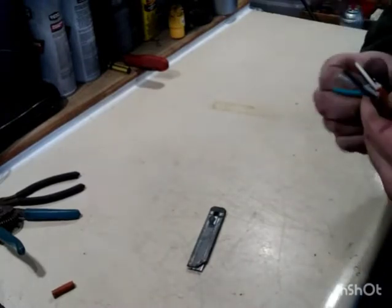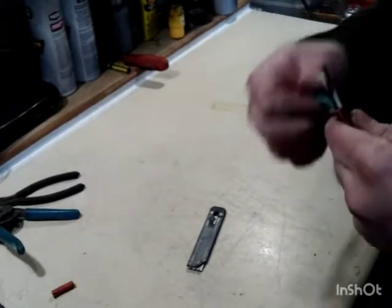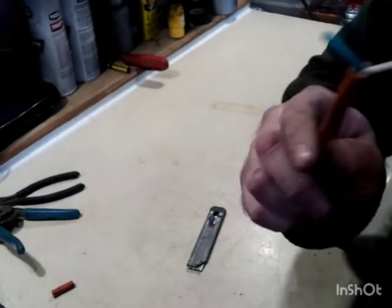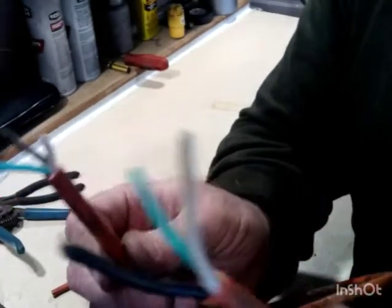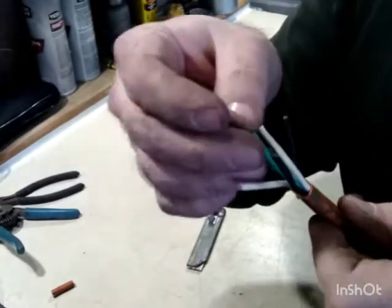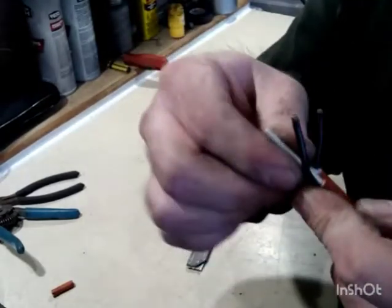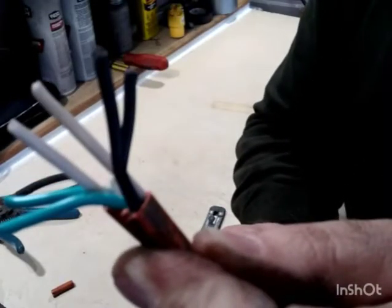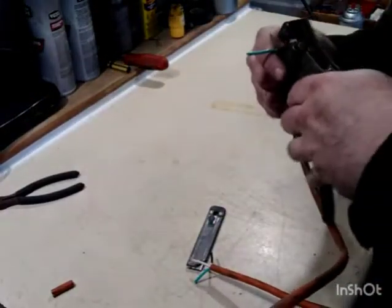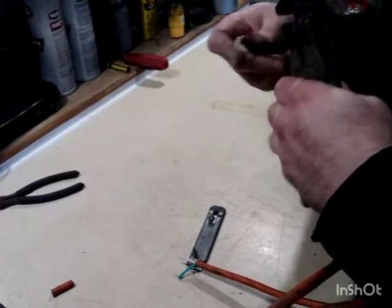Let's take off the insulation. Inside the insulation, we've now got three wires. A good thing to remember is the 110 wires have to have three wires in each bundle. All you're going to do is put green to green, white to white, and black to black. I'm just going to strip them back and tie them in — you'll probably need about a half inch or so of wire sticking out. So we've got close to a half inch.